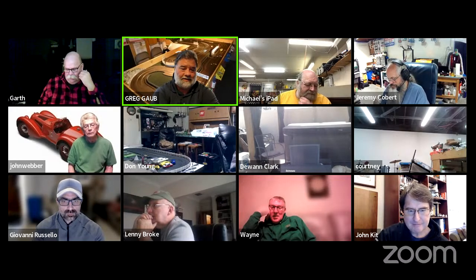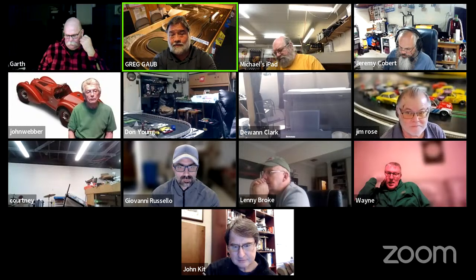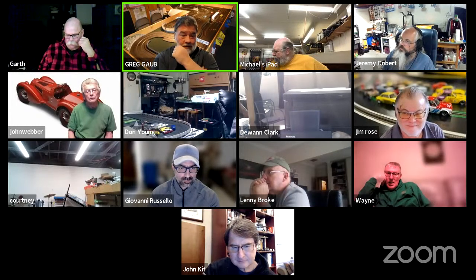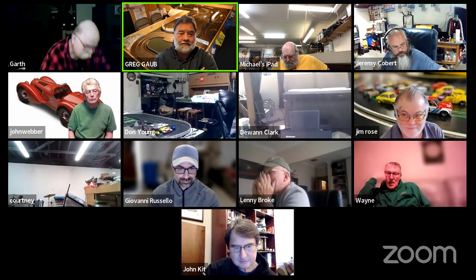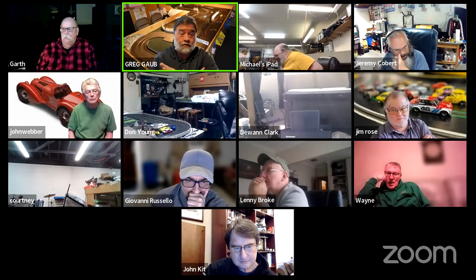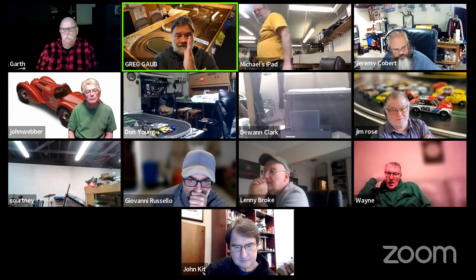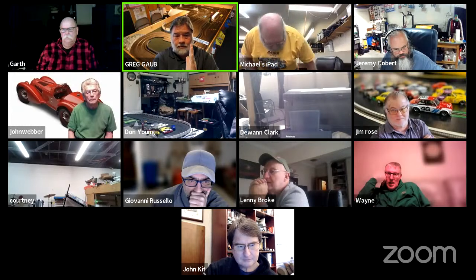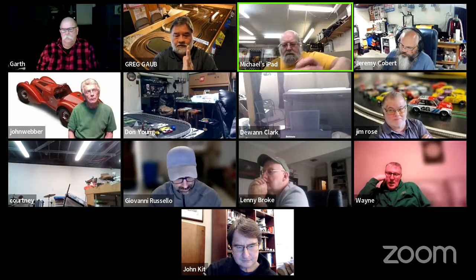It's one that we've seen in other slot car chassis for the pod nuts, to allow them to be adjusted from the outside without having to take the body off. That's basically having an injection molded plastic nut. So it would work fine with your SLS printed nuts, as long as the hole is the appropriate diameter for whatever screw you're going to use. Put a fin on the nut and then a channel for that fin to go up and down in, but won't allow that nut to rotate beyond the tolerance of the fin in the channel.